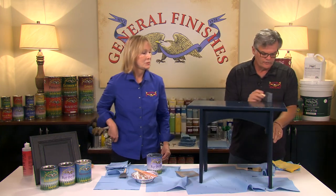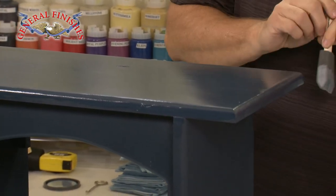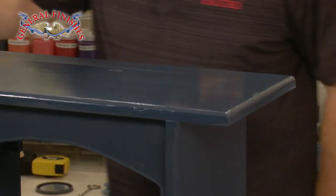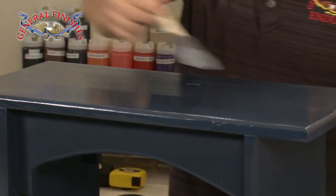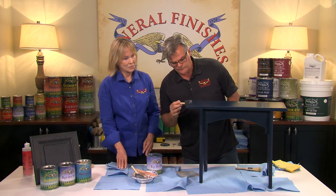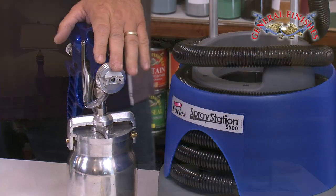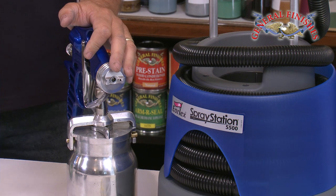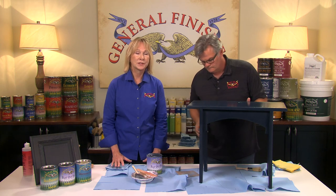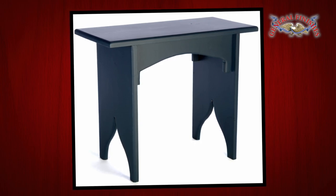Some projects we're always going to say two to three coats of finish. The more use the project is going to get — if it's a bench used as a coffee table or in a children's room — a couple of extra coats of finish will just protect your work. Come back with your second brush if needed and touch up any areas. For large projects, use a sprayer with a medium sized fluid tip — see our spraying video for details. Whatever your application method, we recommend three to four layers of top coat. Let each coat dry two to four hours and sand between coats with a 220 sanding pad. And this is how the bench looks finished with three coats of Flat Out Flat.